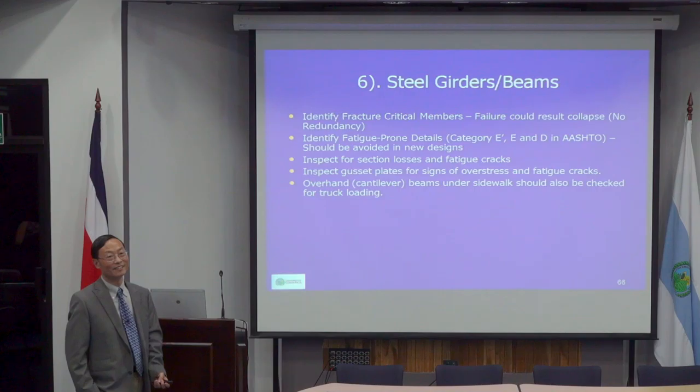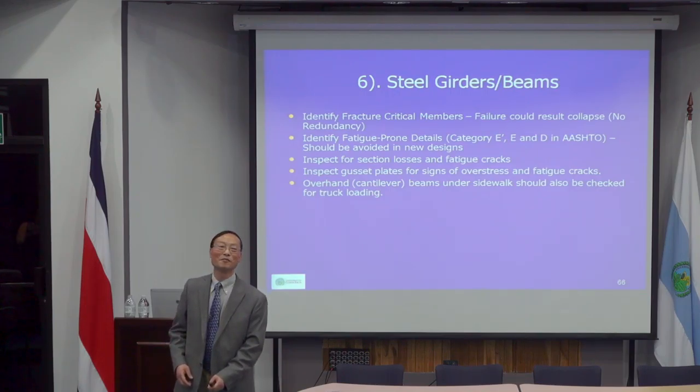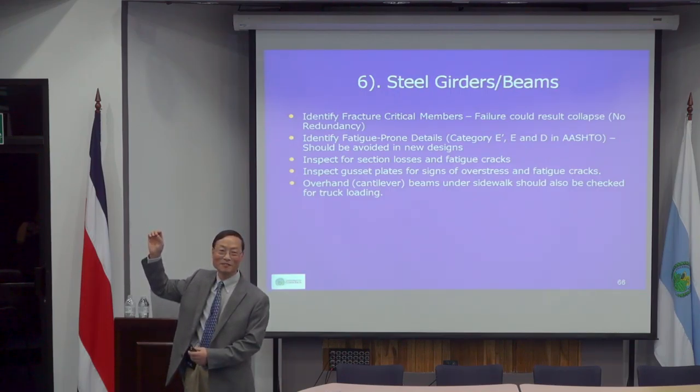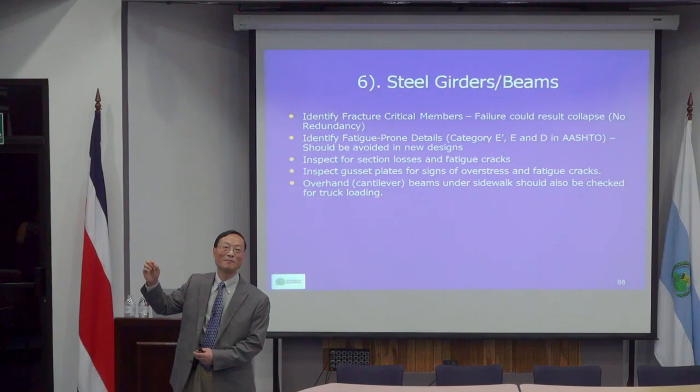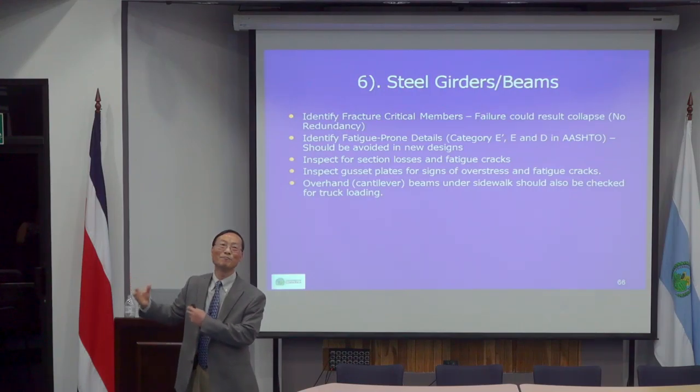Okay, I have a question. When you are using a shotcrete grid, how do you measure whether the concrete that you put there has a connection with the old concrete? Yeah, actually, there are two elements. One is bonding. Research found there's no real issue of bonding, because the grout is usually very high strength, almost twice as strong as the original concrete, especially with fiber. So there's really no issue of separation.